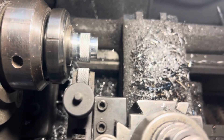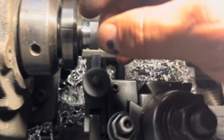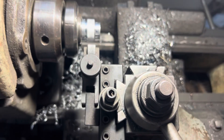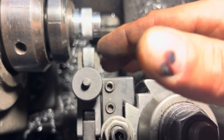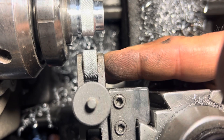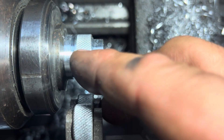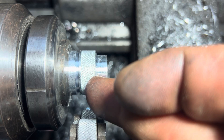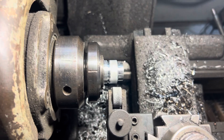All right guys, I'm not going to show how I got the knurl done, but this is the cheap knurling tool I have — this thing has so much slop in it, it's hard to actually get a consistent knurl out of it. What I try to do is set it so that if I push all the play one way, the knurls look parallel to the surface. I'm going to come in and shape this a little bit, give it a taper on both sides to make it look a little snazzy.